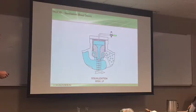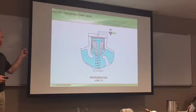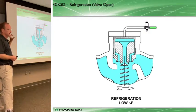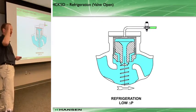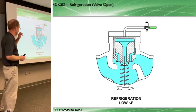What we're waiting to have happen is when the pressure on the inlet and outlet begin to equalize. That opening spring overcomes the pressure on top of the piston and it goes open. The real key is it's not based on time - it's based on pressure differential across the valve. When we talked about what's the right amount of time, it comes down to pressure. It could be five or ten minutes. This valve - because of the piston geometry - waits for about 10 pounds differential. When you get about 10 pounds differential, the opening spring overcomes the upper force and allows the valve to open.